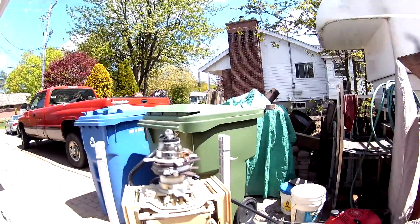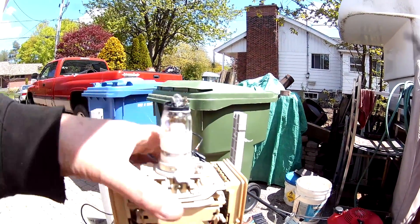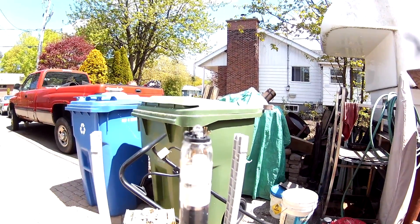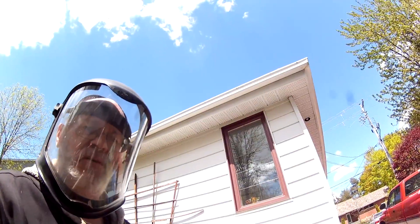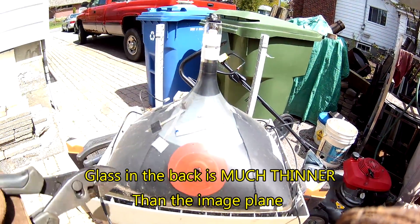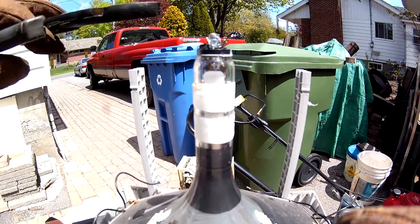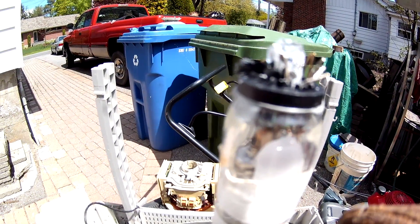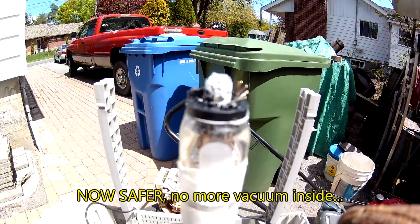Best way: get as close as possible to those steps. I untied all the rings — this can be removed by just pulling on them. You'll want to wear some gloves, protective gear, and a hood — big heavy gloves. Now we're ready to let the air in. You do not want to knock on these parts because it's vacuumed in there; that will implode and release all kinds of pieces of glass. But if you just puncture the tip at the end where it's been vacuumed in, you'll just hear the air rush in. That's it — that tube is pretty much not dangerous anymore.